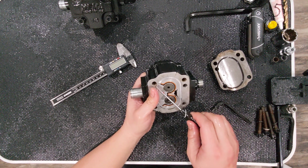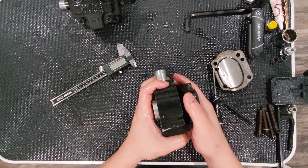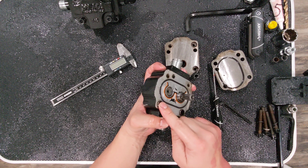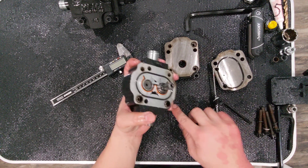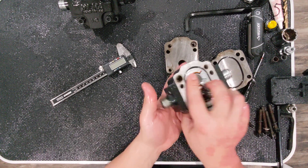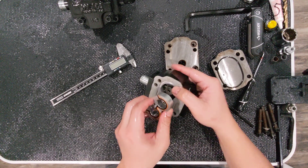Pulling these bushings off the back — the back really looks the same, but the difference is the output shaft. The back also has hollow dowels that fit into specific holes. Sometimes you'll see pumps where all four holes are cut to allow easy reversal of rotation direction. In this case, it was really built for one specific application, so these holes aren't big enough to handle the dowels if you wanted to reverse direction — you'd actually have to mill out those holes.